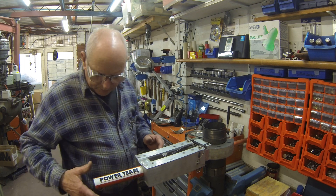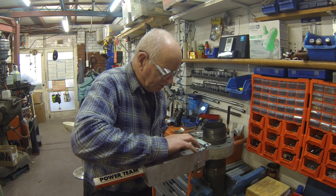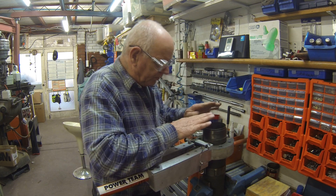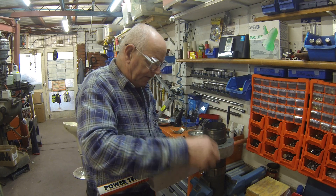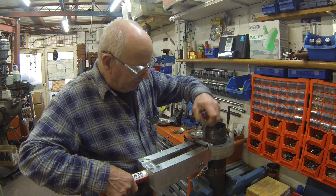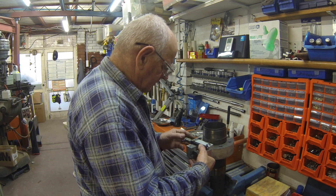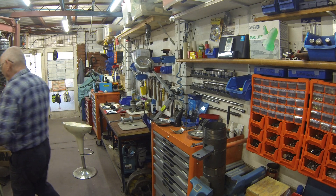Once the pressure is applied to the cylinder, it will push the blade through the window, and it'll stay there with the weight of the core sitting on it — it won't go anywhere. The hydraulic cutting mechanism then gets removed, and the clamp arrangement is taken off while the blade is left behind under quite a lot of pressure.